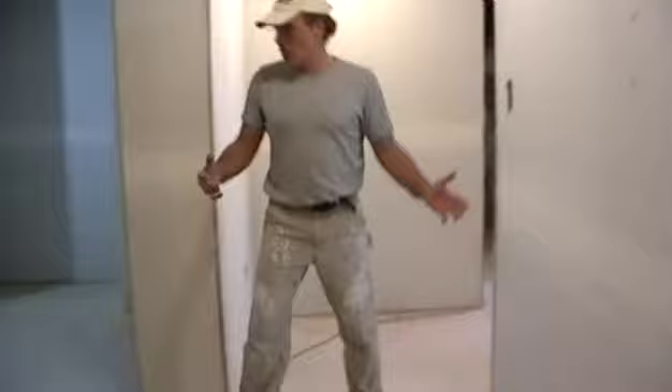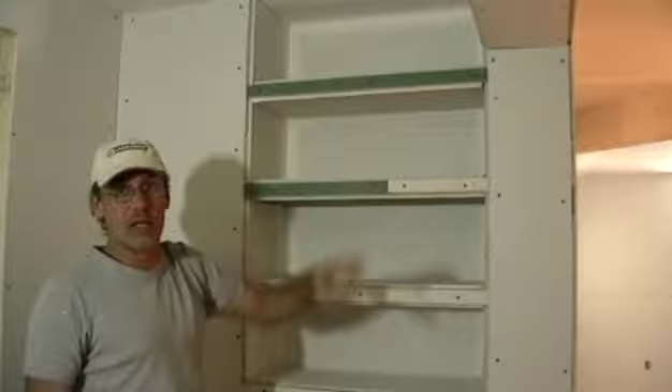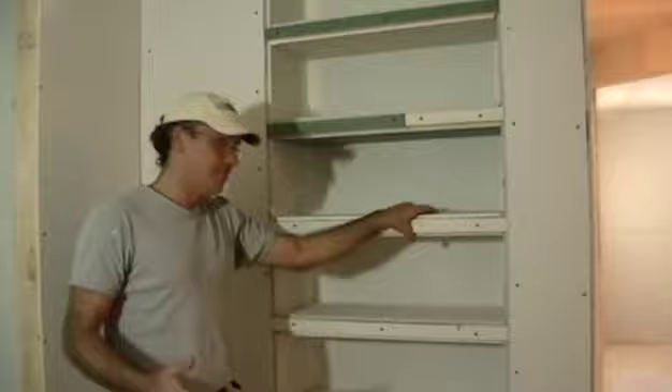We'll go into this closet area. If you come around the corner, there's a lot of shelves - these are drywall shelves on this wall over here. They all have to be taped. Corner beads will be installed top and bottom - they're all round and bull-nose corner beads - and all three coats: taping, second, and finish. Finish the corner beads and make them look nice. It does take time, but drywall really, really looks nice when it's done.